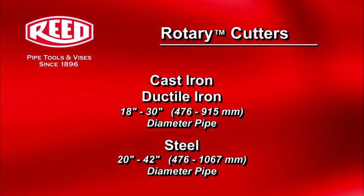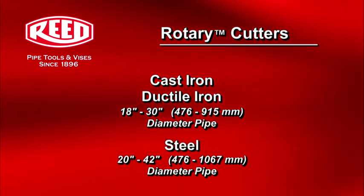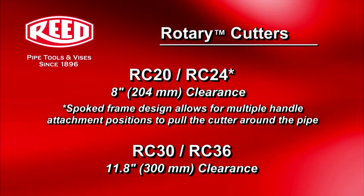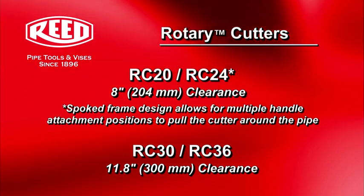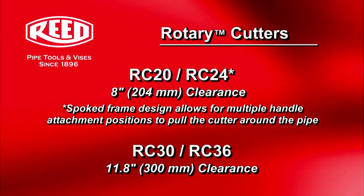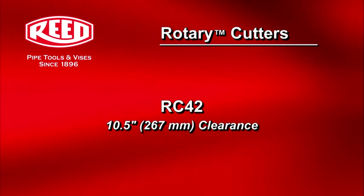Rotary cutters can cut cast and ductile iron pipe ranging from 18-inch to 30-inch and 20 to 42-inch steel pipe. The RC20 and RC24 models need 8 inches of clearance, whereas the RC30 and RC36 models need at least 11.8 inches of clearance. The RC42 model needs 10.5 inches of clearance.